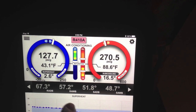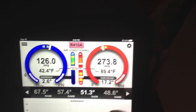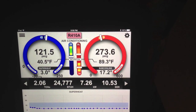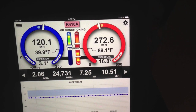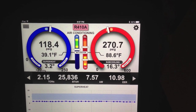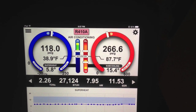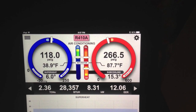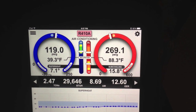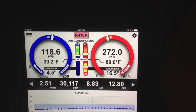Now you can see, even though we're inside here, it's still updating from the wireless probes. That's going to the I-manifold and then from the I-manifold via Bluetooth to the smart pad here — the tablet. So you can see we're up to 24,700 BTUs of cooling. What I want you to notice is a couple of different things. Number one is it takes time for a system to start producing its full cooling, and this is what SEER is about. SEER rating is about the amount of time it takes for the system to reach its full cooling. It's been running about a minute and 26 seconds, and we're up to 29,000 BTUs — almost up to where we were at before. We're at 2.47 tons on a 3-ton unit, and now you can see that's sort of settling out.